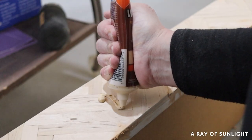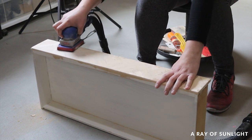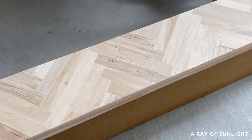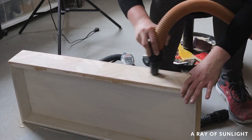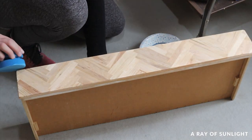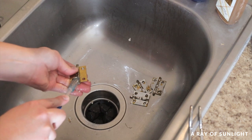Then I put natural colored wood filler all over the sticks to fill in the gaps. Once it was dry, I sanded the wood filler off, and I ended up doing this whole wood filler step two times just to make sure everything was filled in. It looked so good. Then I cleaned everything off and top coated the drawer with three coats of matte poly using a little sponge. Before putting everything back together, I cleaned the paint off the hinges by putting them in boiling water for a few minutes — the paint came off pretty easily.